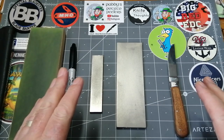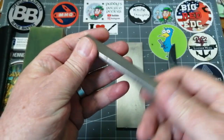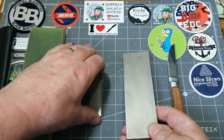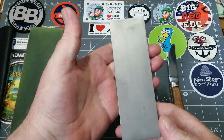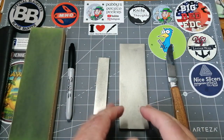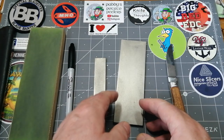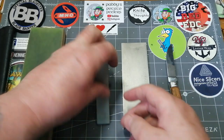So what I'm going to do is sharpen it, and all I'm going to use is these DMT stones. This is the coarse, which I think is about 320. This is the fine, which I think is about 600. This cost about £15 or $15. This one cost about £35, but I bought it before I realized I could get these. For hand sharpening it's quite heavy, but it'll last a long while. The diamonds — just don't put any weight on them and they'll last you for ages. This is a great little hand sharpening stone.